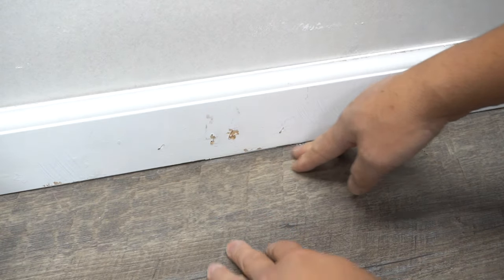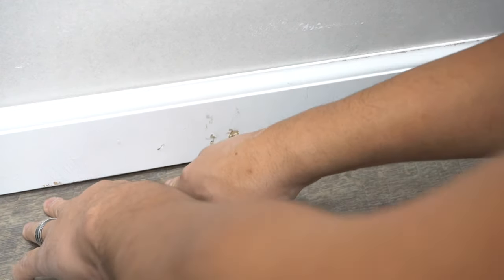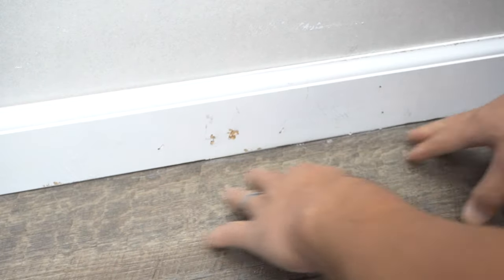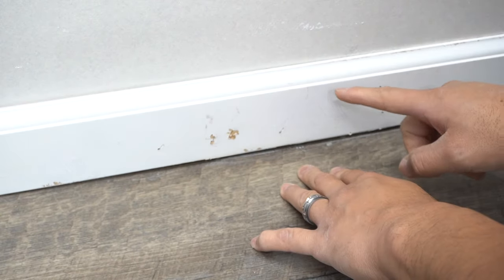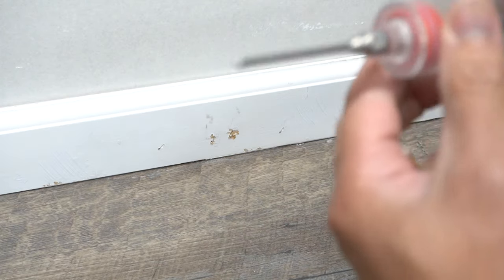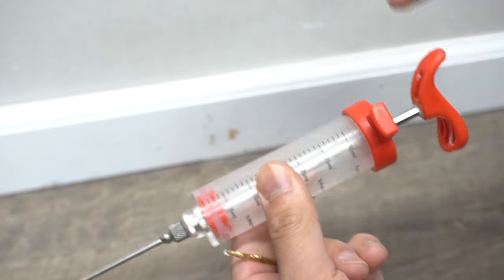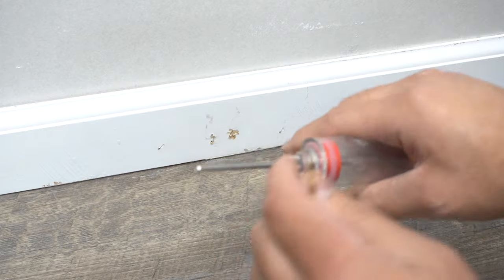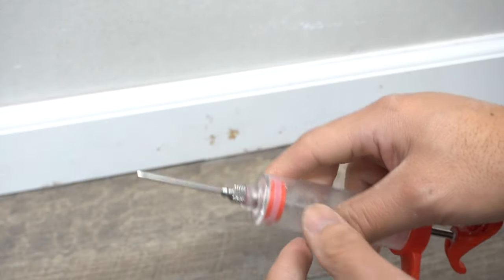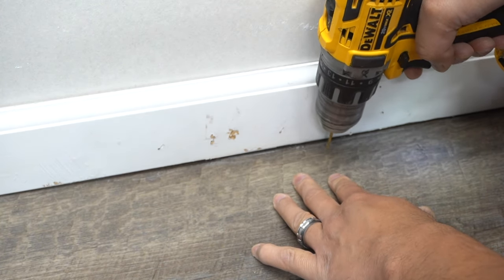Looking at this flooring, it looks fine, but if you push down on there, there is a hollow spot somewhere around here. You might have to go and push down on some areas to find where it stops, and you're going to have to assess where that hollow spot ends. You can mark it with masking tape. This will apply on vinyl plank and laminate flooring only. The syringe that we're going to be using — you're just going to have to match how wide the syringe is. If you're interested in this syringe, I'll leave a link in the description down below. This method might not work for everybody. Make sure that you check the warranty on your floor — if you have a warranty, I would not advise you to do this. But do this at your own risk. Once you find your spot, you're going to drill right where you want to put that syringe.